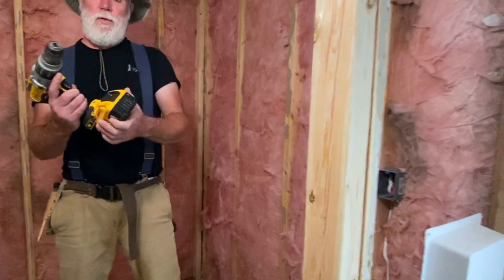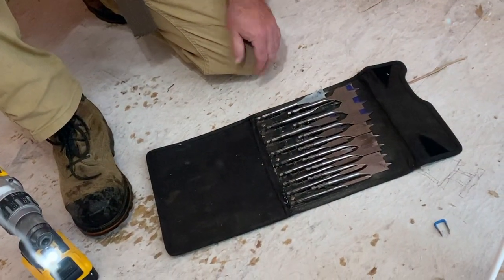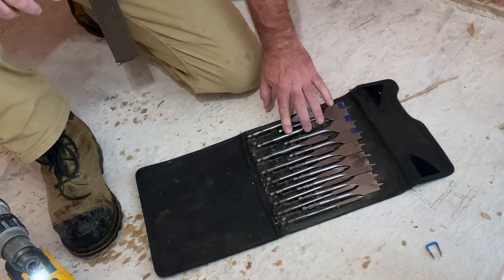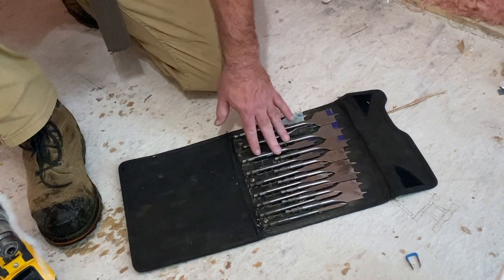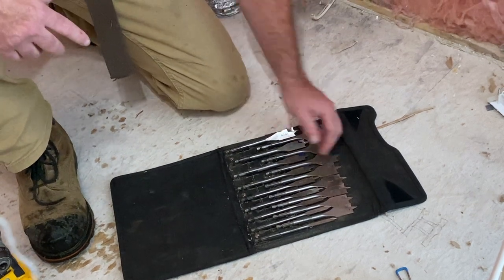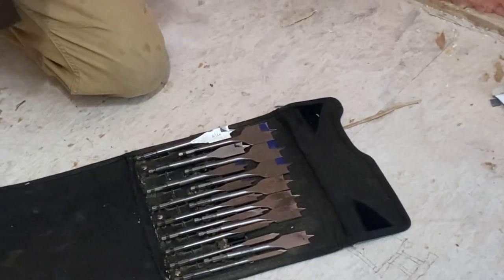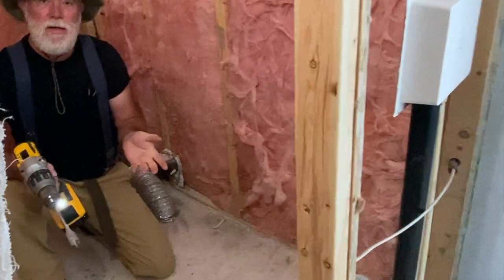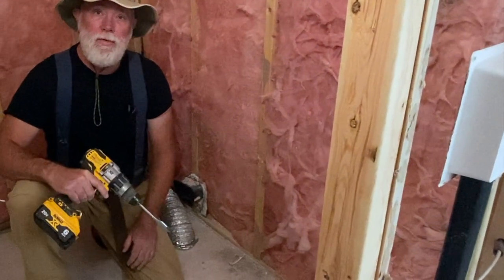We needed the battery for the drill, and then we need some paddle bits. You could use auger bits to drill these holes — I like the paddle bits, they're a little bit more versatile and come in real handy in a lot of other situations. This is a fantastic set from Irwin; I found it in a discount rack and paid $5 for the whole set. We just want something big enough for the wires to go through — I'm going to grab a 7/8. We're going to be drilling a hole right through the middle of the stud. You may be concerned about that, but the outside edges of the stud are still intact; it'll still be load-bearing. So don't be concerned about putting a hole through the middle of the stud.